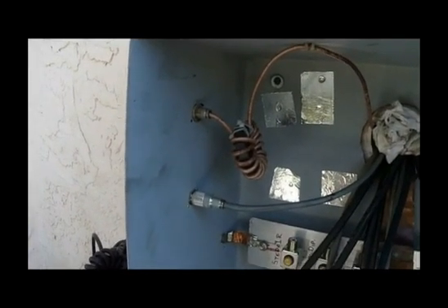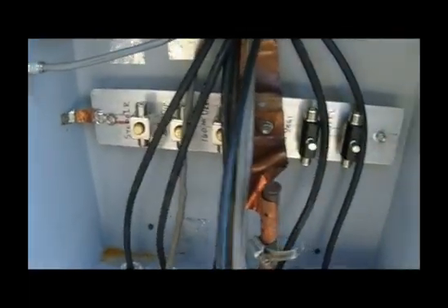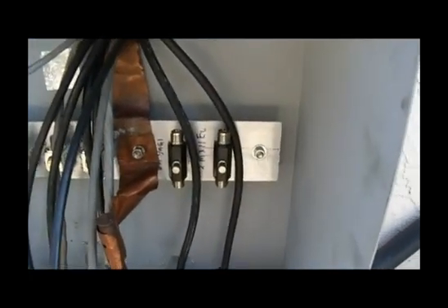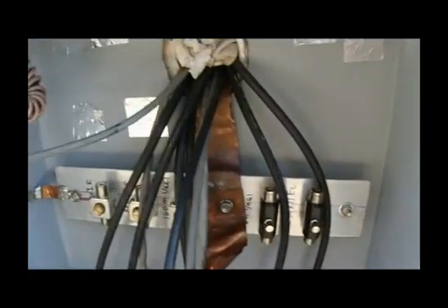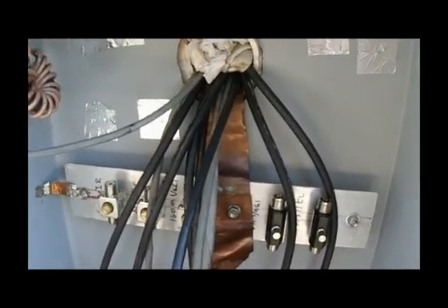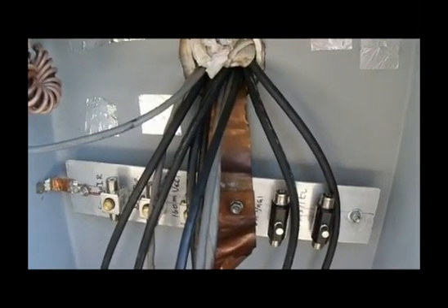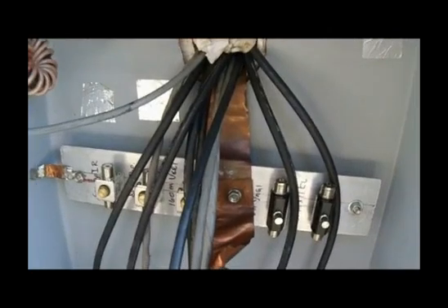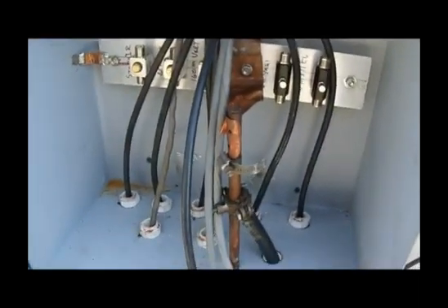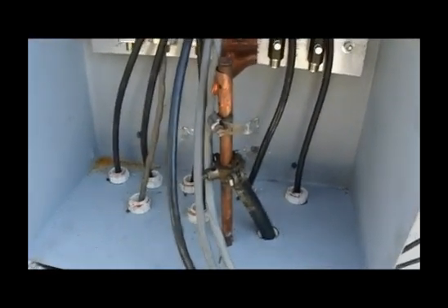Below that Waller flag is the coaxes going into the shack for the magnetic loop. There's the bus bar for all the lightning arrestors. You can see the 2-inch copper strip coming in from the shack, and it goes down to the ground rod, as well as some 4-aught cable that goes out to a well casing that is 60 to 80 feet in the ground. That's my basic ground system for the shack.